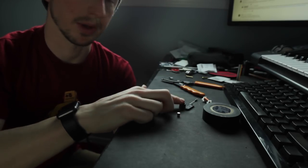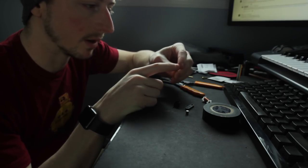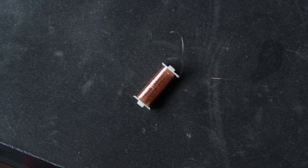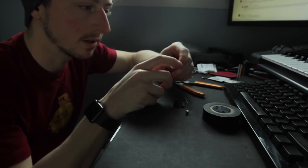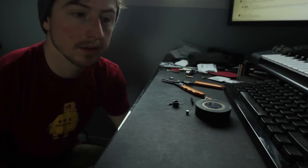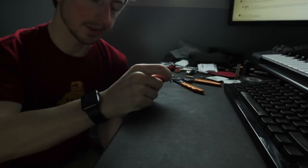Now that you've 3D printed the main body parts, the other parts you're going to need are: a magnet (I'll leave a link below), a resistor — I'm just using it for the thick lead wire as a metal rod to hold the centerpiece in — and some thin gauge wire. You can buy this or scavenge it from motors; this one's out of an old cheap electric clock and has really fine wire. You'll also need a small amount of electrical tape to hold the leads in.